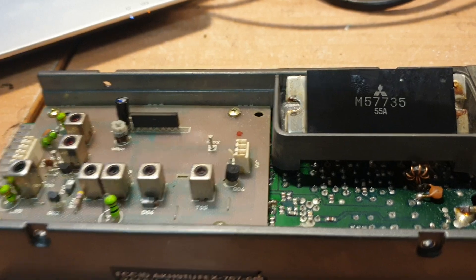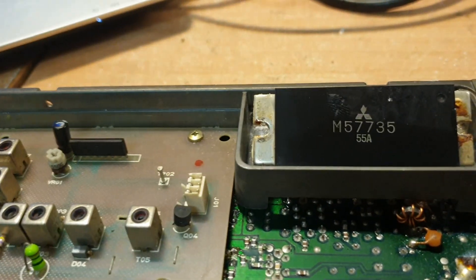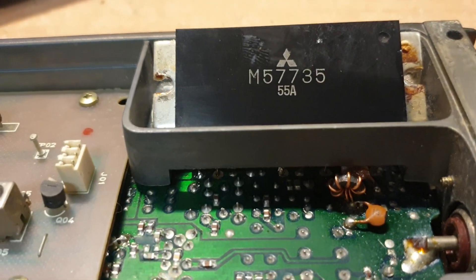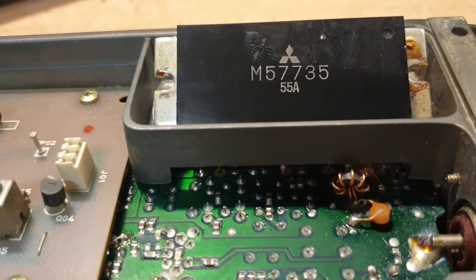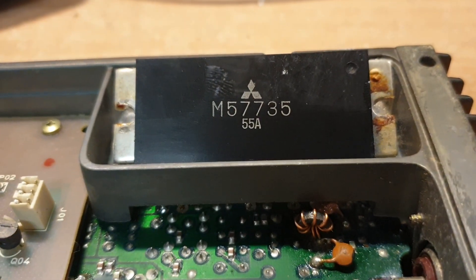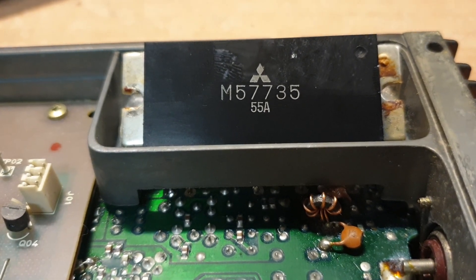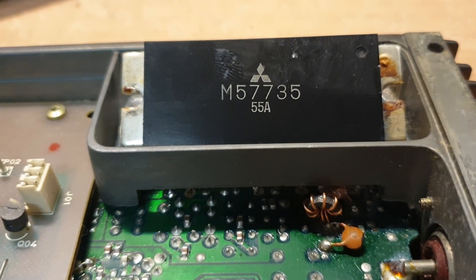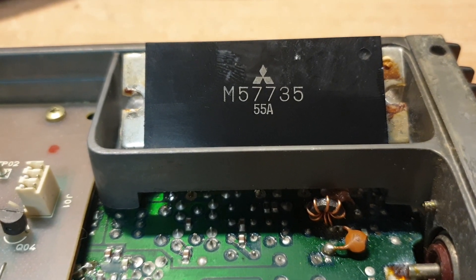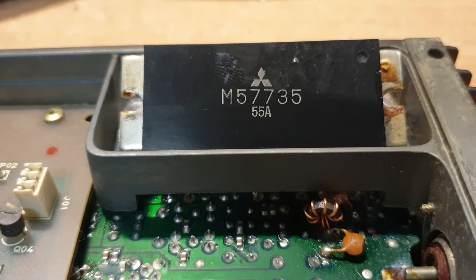If not, what do we do? Well, we take up all this space here, we take the pre-drive and probably just add a little driver circuit, and we put something else in there that's going to work at six metres — and it won't need to be a module that big, to be honest. We've got a lot of space to play with, so that would be the next sort of way you'd deal with this. But anyway, this is sort of part two — just really proving, I suppose, my belief that that module is certainly in a lot of trouble.